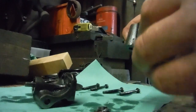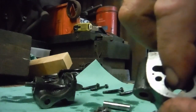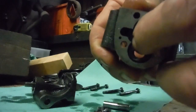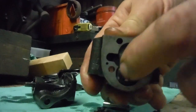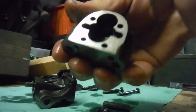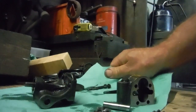On top of that — and I don't think the camera will pick it up too well — there's a little bit of wear, a cutting into the face of the back plate. I can feel it with my finger: there's a step between where one gear runs and where the other one runs. So this pump, although it doesn't actually look too bad visually, is worn out.